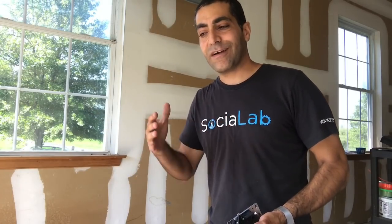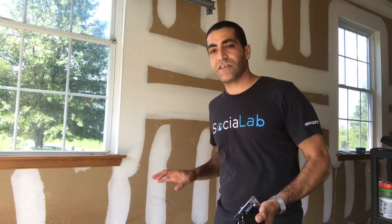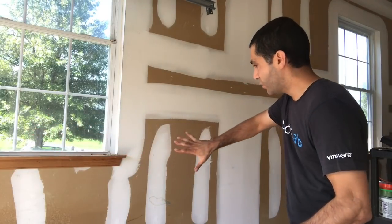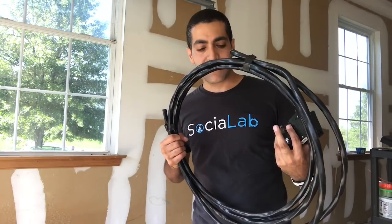In my situation I'm putting it on a cold wall. I'm not an electrician, so I know an electrician would have drill bits and techniques to punch through all the studs without ripping open the sheetrock. My problem is this is a cold wall with insulation, and I don't know what a large drill bit is gonna do - it's probably gonna mangle up the insulation. So to greatly simplify it I'm actually going to cut open a one-foot-wide section in the wall from the outlet location all the way to the panel.